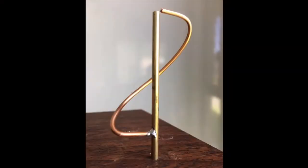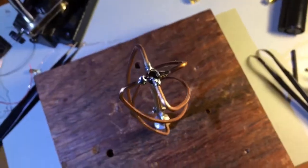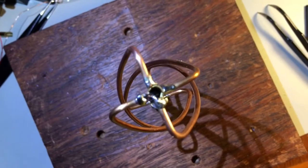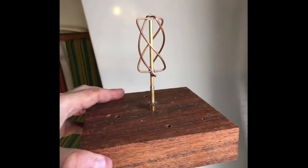When the coax is run up the stem, the lobes that are 90 degrees apart are connected together. So the centre conductor connects to two lobes that are 90 degrees apart, and then the other two are connected to ground — either the stem itself or the coax braid.